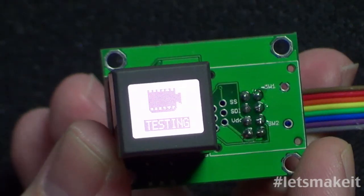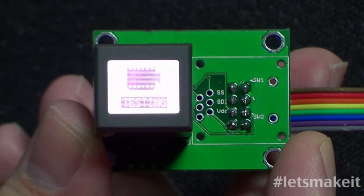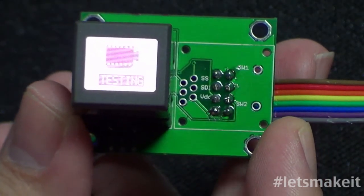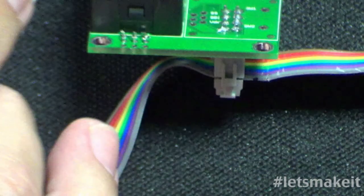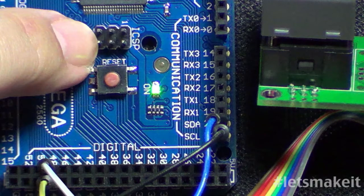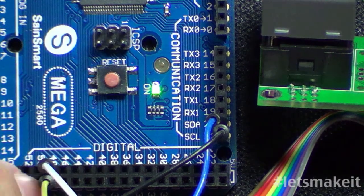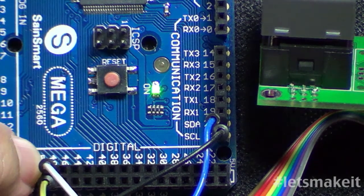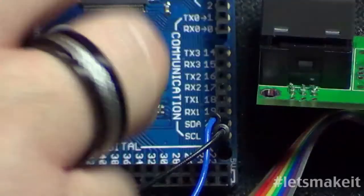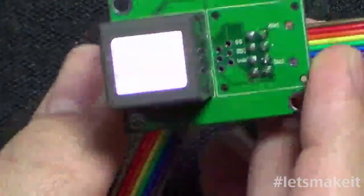However, this smart button itself is not I2C. It is the MOSI, the part of the Arduino that's, actually, I can show you where it is on this Arduino. It typically rides on these little things right here. No, I've moved it in this example because I don't use the ICSP pins on my boards. I actually moved it down to pins 47 and 48, or 48 and 49, I can't remember, 48 and 49. But so it's the ICSP that is actually being used to control this.